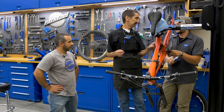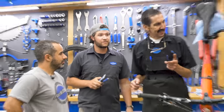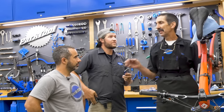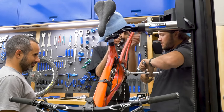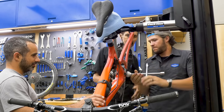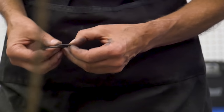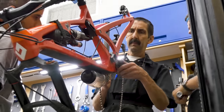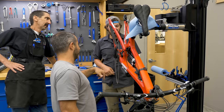Then I am a hack — in the good sense of the word. Because the spacer under the cup is wrong, I'm fixing it the quick and easy way. Mine was a quicker fix because I didn't have to remove the bottom bracket, and I had the thinner seal on hand, so I really wasn't sacrificing performance. But in the end, we like to follow spec. So we pulled it apart, followed the original manufacturer's spec, and again the crank felt buttery smooth.